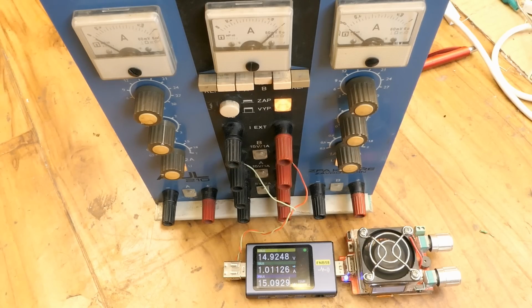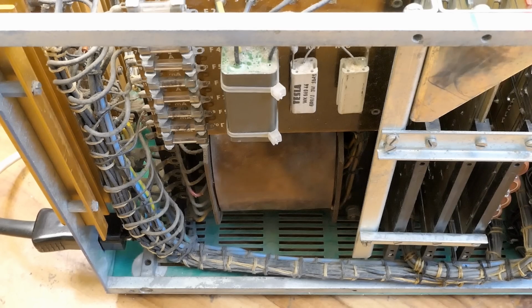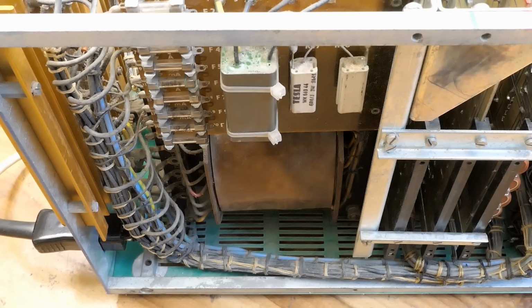But when loading the output B, the buzzing is different. And this is not a healthy buzzing. Normally a transformer is buzzing at 100 Hz. And that's because the magnetic forces and the magnetostriction in the iron core doesn't care about the polarity of the current. And the same applies to a buzzing fluorescent inductor, AC electromagnets, solenoids, relay coils.